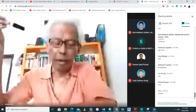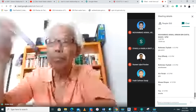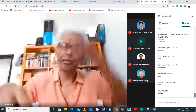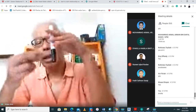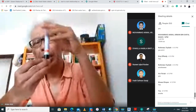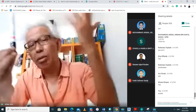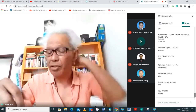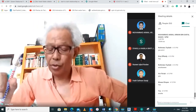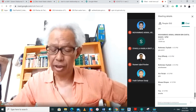All right. And then you notice the skin friction for the cohesive soil. It's linearly decreasing. All right, the line is decreasing to the depth Z. But you know, as you go down, okay, the friction is decreasing, but the sum total of the friction, because the shaft area is increasing as you go to the depth Z, so the skin friction is increasing with depth Z. All right, that's linearly variable, but the last diagram shows the cohesionless soil, which is not linearly distributed. In fact, it is a curve. Okay, this is the skin friction.